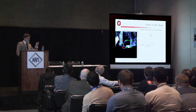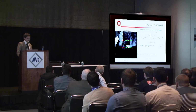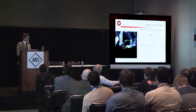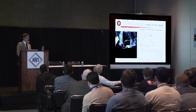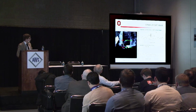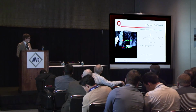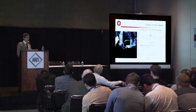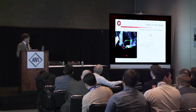So what we see in the CMT weld is, there is some segregation of our supposed bad actor niobium going on, but it's on a scale that is pretty close to the nominal niobium level, which is about 0.8 weight% in the undiluted filler metal. And as we're approaching the fusion boundary, there's really no scatter in this data, partially because we have a finer microstructure in these CMT welds, and there's very little niobium to begin with approaching 304L composition.